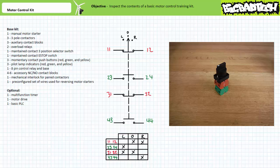When the selector switch is in the right position, only the third and fourth switches on the right-hand side are in their activated states, while the first and second switches remain deactivated: contacts 1-1/1-2 remain closed, 2-3/2-4 remain open, 3-1/3-2 open, and 4-3/4-4 close. Importantly, this three-position selector switch is maintained contact, meaning that when placed in the left, center, or right position, it does not return to a deactivated state until an operator actively moves the switch into a new position.